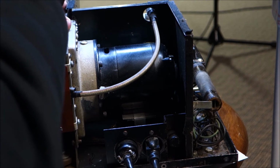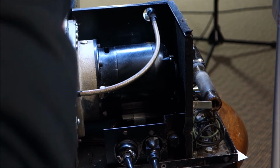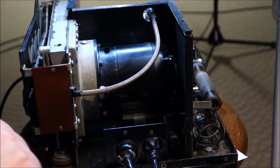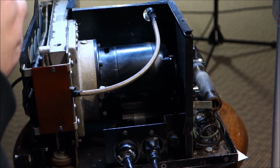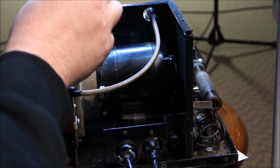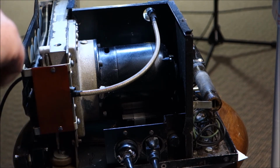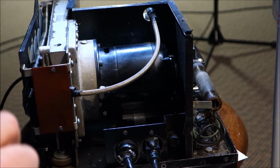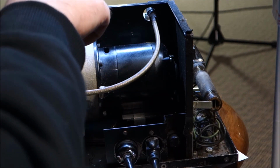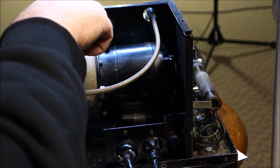The cork right here is the one you use to open the gearbox. You take the cork out. And then we'll put about 6 drops-ish in here. Not too much, just a little bit. There we go. And actually, I'm under a fairly good impression that this unit has been oiled regularly. There was some residue all over the place that I cleaned up. So, I don't think it's because the gearbox is leaking. They seal those pretty darn well.